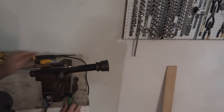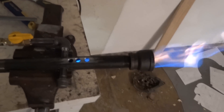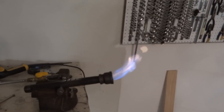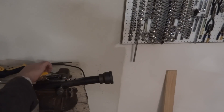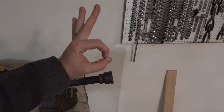Slowly open the regulator. There we go. You see the problem? It's burning inside the tubes there — that's not supposed to be lit up. Also that's a very rich-looking flame, a lot of yellow. I'm going to crank it up to see if I can get the flame pushed out. It appears those hole changes made zero difference.